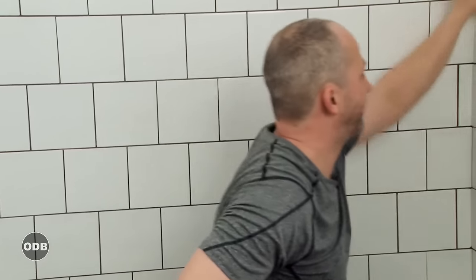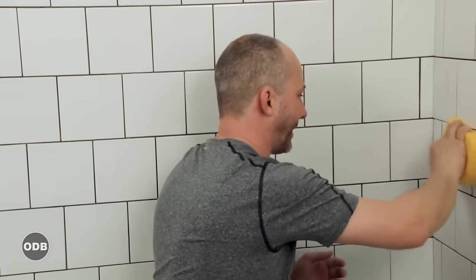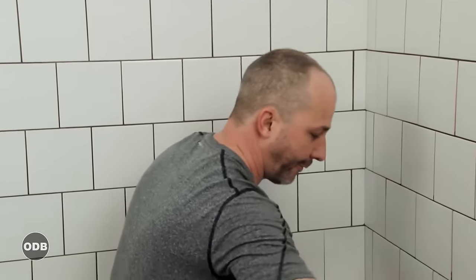The reason that's so important is because over time, even if I used a white cement with a white grout, they'll be different color whites and they'll discolor. Six months down the road the client won't be happy with the look because they'll have different textures and different colors poking through the wall. This way I can ensure the maximum amount of quality before I leave the house.